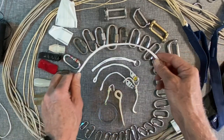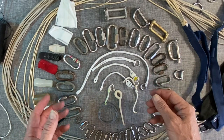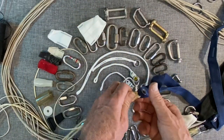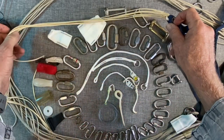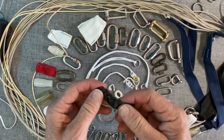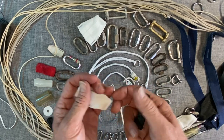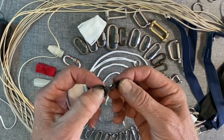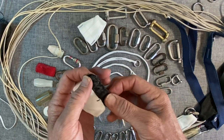Things I didn't like so much about the soft link was they are susceptible to heat damage, particularly on the tandem where you have five meters of line with the slider rushing down and then it stops right there. It potentially would go melting through your soft link. In the early days when we were running Dacron line on tandems and you couldn't really get a proper protector to cover where the slider was sitting, I would make Type 3 covers — and you can see how this one has burnt up, just from the friction and heat of the slider grommet.